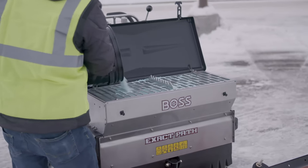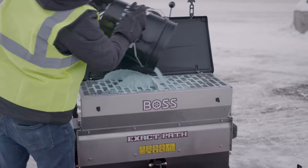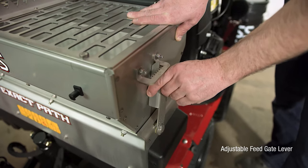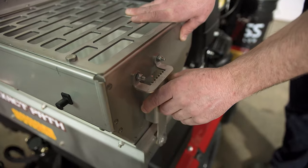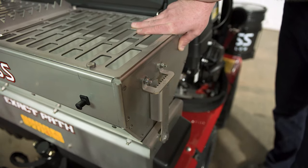On the side we have an aperture opening which allows you to adjust the opening in the bottom of the hopper to account for different size granular material. The manual aperture opening on the side of the spreader is really what allows you to adjust for different size material. By simply manually moving this on the side of the hopper, you open the bottom up, allowing larger or smaller material to fall through.